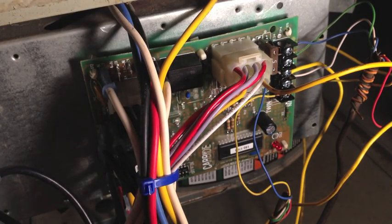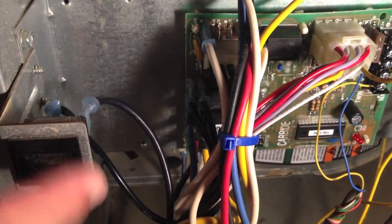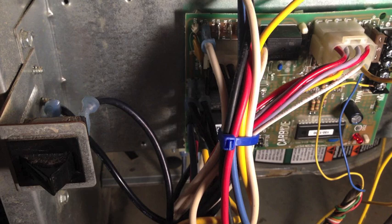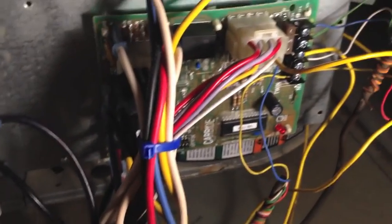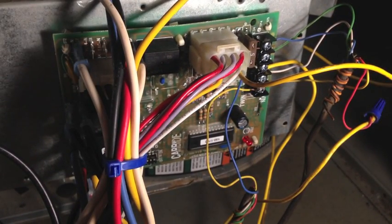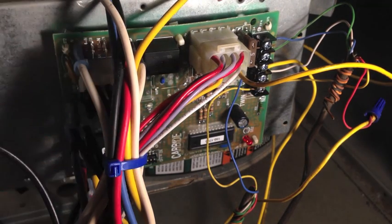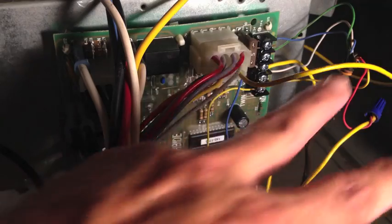So if you're trying to investigate what might be wrong with your HVAC blower not working, use your safety switch — supply power straight to the motor. Look at your schematic to see what lead is the high-speed fan lead, and plug it into the back of the switch on the discharge side. Maybe you'll figure out without taking the motor out that your motor is not bad and it might be your circuit board. Or just take the circuit board off, look at the back, and look for a fried solder joint. That's how a non-AC guy fixed his AC and saved a ton of money on a service call. Be careful if you try this — shut off the power, do everything right, use the schematics, and good luck. Peace out from Georgia.